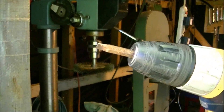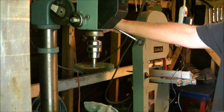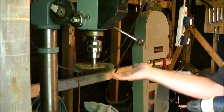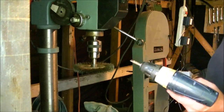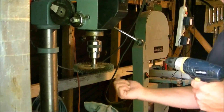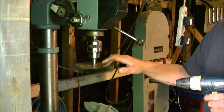As you can see, this is really full of rust — bad. To clean them up, you just need a wire brush. I've got mine on a drill press. If you've got a bench grinder with a wire brush, it works the exact same way, except instead of on the horizontal plane you'll be on a vertical plane. You want the drill running in the forward direction, going against the direction of your brush.